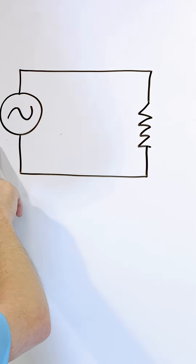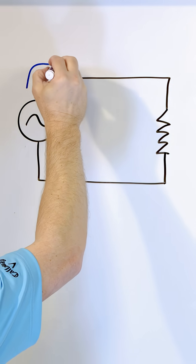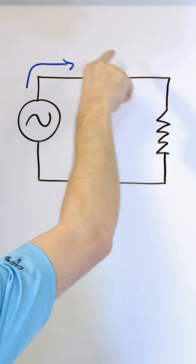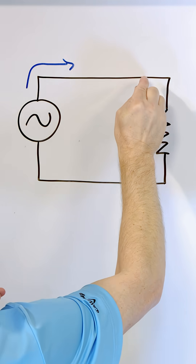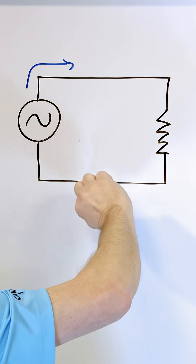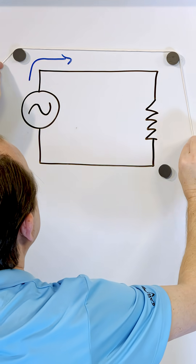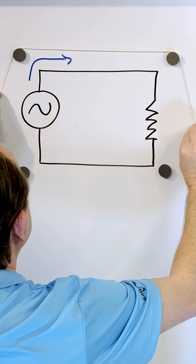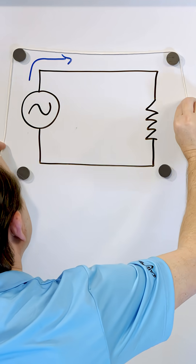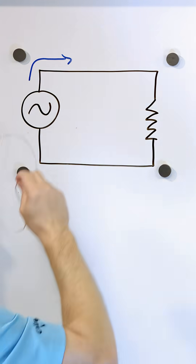Here is a circuit with an AC source. You can think of this resistor as being a light bulb. The electric current flows out of one side, but it doesn't go in one direction forever — it actually turns around and goes back through, alternating in direction 60 times every second in the USA, and at different frequencies in other places around the world. It's very helpful to visualize the current as a string: instead of going in one direction, it basically switches and changes direction, going back and forth at the frequency of the source, which in this case is 60 times a second.